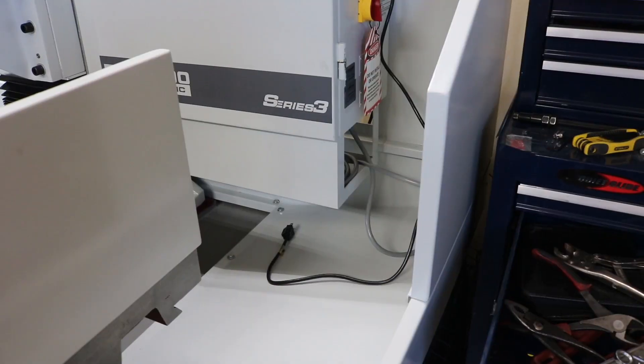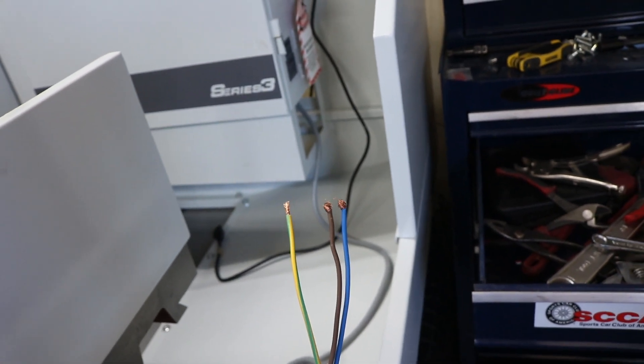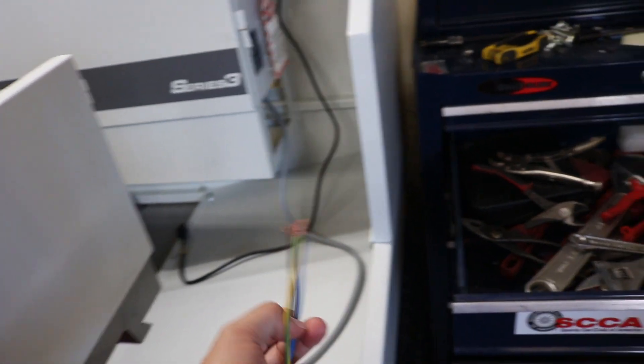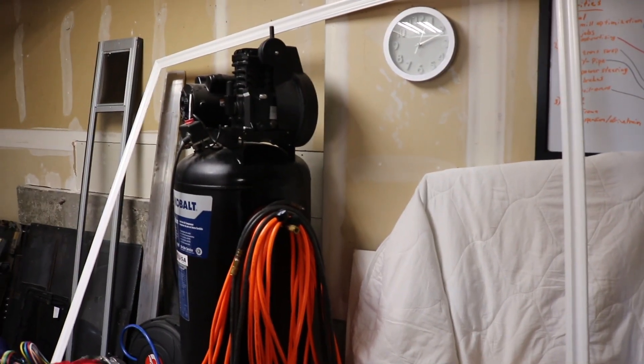Let's go out to the garage — I'll show you where I'm at with the mill. The Tormach should be pretty easy to wire up. It's got a little cord here, and at the end all you're looking for is single phase 220. I'll have to read in the book which wire is which — you should have two hots and a ground or a neutral. From mapping out my breaker panel earlier, I'll run those two breakers giving you two hots up to the wall over here by my air compressor and put a sub panel in over there. That way the air compressor, the mill, and the MIG welder can all be plugged in. That's about all I've got for this week — hopefully next week we will have this thing running, that is the goal. I've already got my shopping cart on Home Depot filled with electronics to get power to this thing, so hopefully she'll be up and running. See you next time.